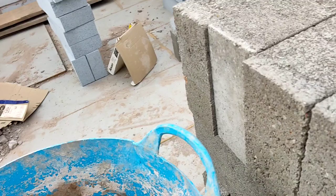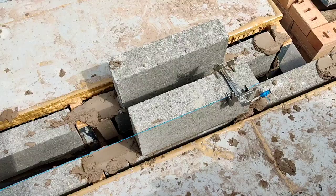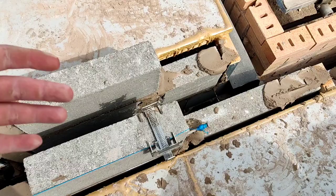So this is what I do, this is what I should have done in the other video. Got a block on each side, fixed bricked it, away we go. I'll show you. I ain't got long, I've only got 25-30 minutes for the locking side up, but I've dotted that on now. That's the thing with a fixed brick. You can dot it on, it's not going to pull your block. Doesn't take a load of squeezing.